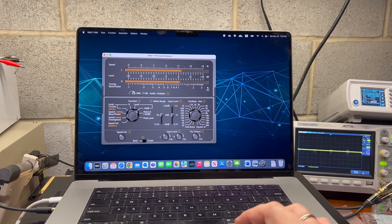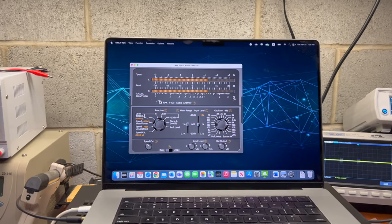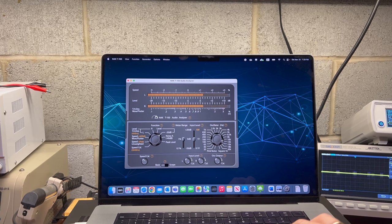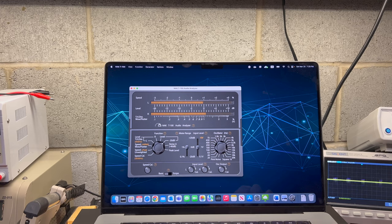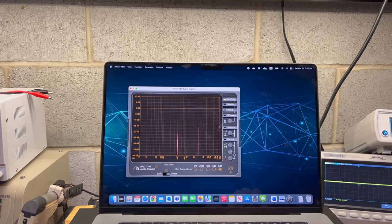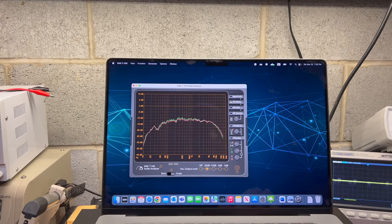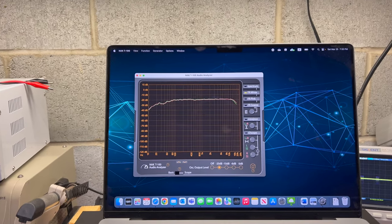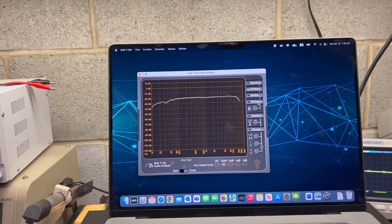Let's switch to minus 20. Let's check 10 kilohertz. Okay, bias is there. Source, tape. Good. 12, 15. Source, tape. Bias there. 18, drop. Okay. Now, let's see minus 20 decibel. What it will give us. In the recording, it goes up to 16 kilohertz. It's flat pretty well, and then it drops.